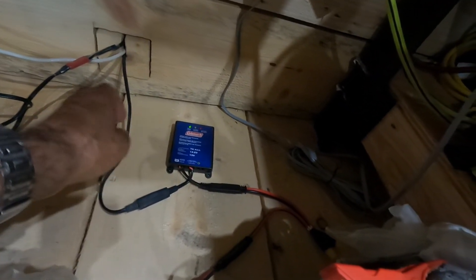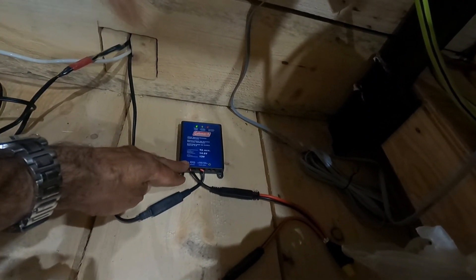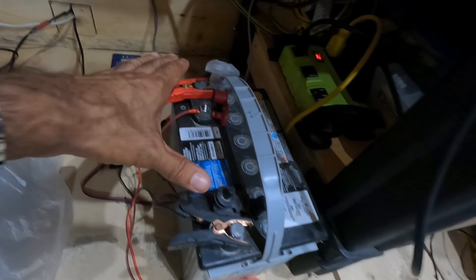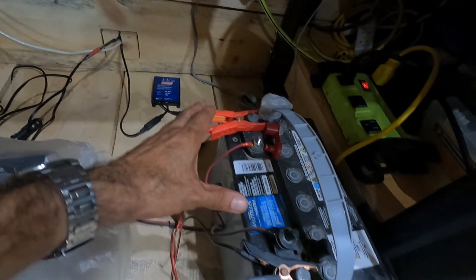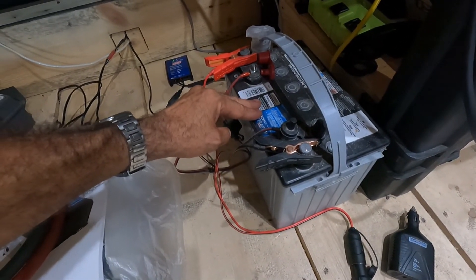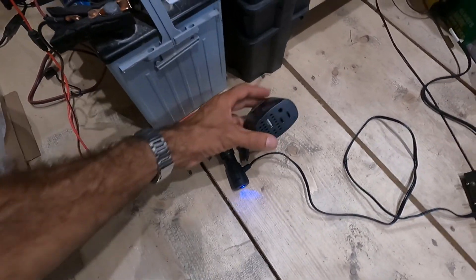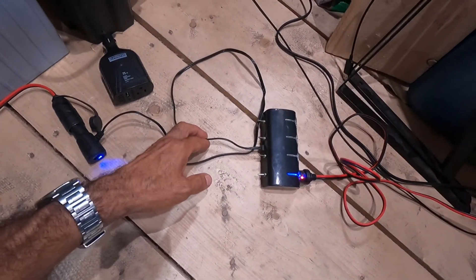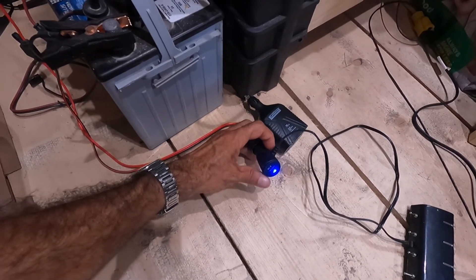I mentioned that I have two solar systems. Those loose little panels you saw outside connect to this little PWM — pulse width modulation — charger, which will deliver a maximum of 7 amps to any battery I can connect. This is an older system I used to run in a trailer off the grid. What this allows me to do is take, for example, this little 80-amp-hour battery, which provides 12-volt power. I can use that to run anything you can run off a 12-volt socket, such as a small inverter or a hub — to charge cell phones, tablets, whatever rechargeable technology you have.